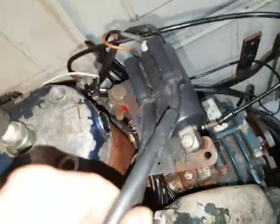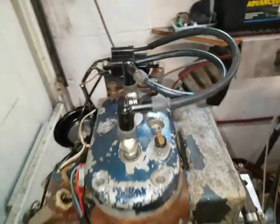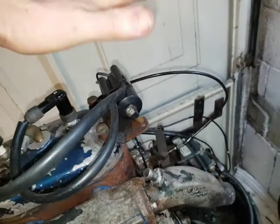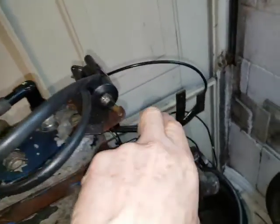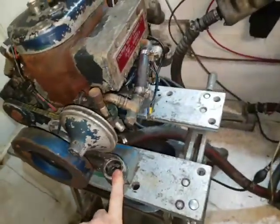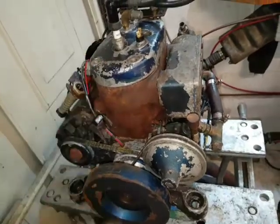This looks like a motorcycle ignition unit, probably from a Honda or something, and that's an issue because in its installation position, it's right up where you've got connections and the coil. I think you could possibly get this damp, because if you've got a hatch over the back to deal with all of this, it could drip, and then you have salt water on the HT unit, which can then drip down onto the ground, so the whole engine becomes live, and you might get electric shocks off touching the engine because you cannot guarantee it's earthed to the seawater unless you've got a hull anode connected to this. You could still get shocks from it.